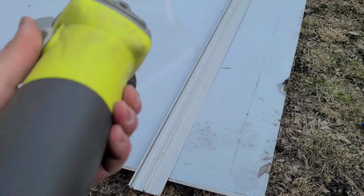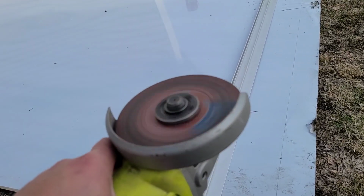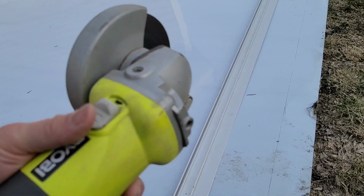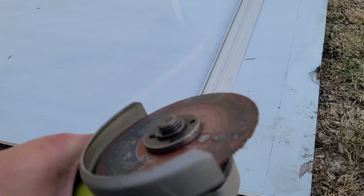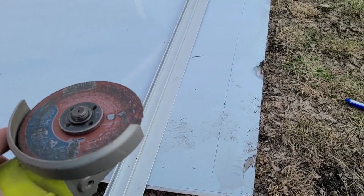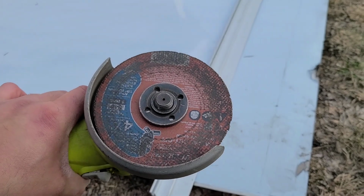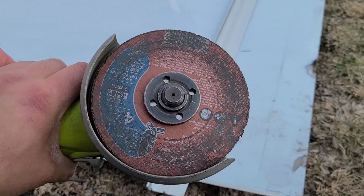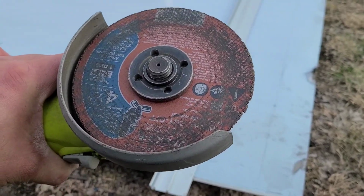And that way it has a nice clean edge right there. And what you do next is you literally take your angle grinder, tie it right up, and don't be scared. Maybe the first piece you're like, how does this metal cutoff wheel cut metal? I don't know the science behind it, but it does. And that's what we use to cut every single piece of stainless steel. And it goes through these like no other. You're gonna go through a big pack. So buy a big pack. When you buy one, I'm gonna link it in the description. Buy the biggest pack you can, because you're gonna go through them like butter.